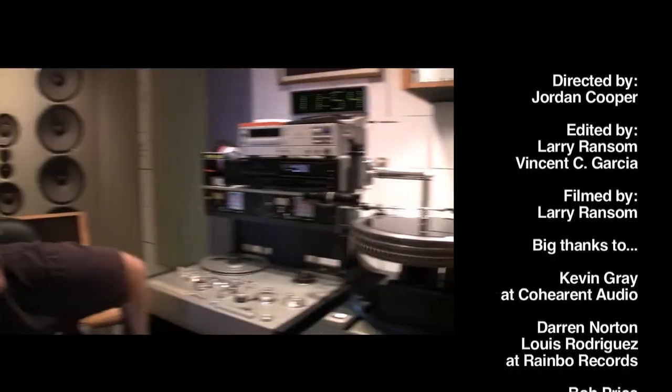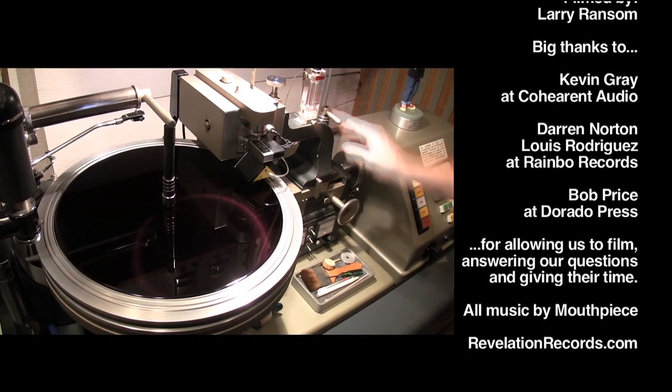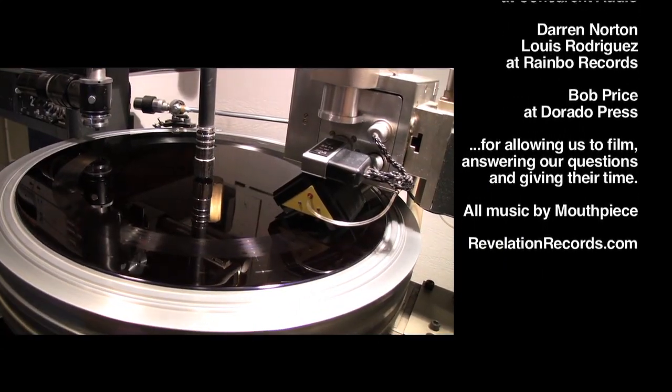And that adjusts the groove spacing by knowing in advance what's coming. So it has to look at the information prior to cutting the groove. In this case, it's about a half a turntable revolution. And it adjusts the groove spacing and also the depth of the cutting head for maximum volume and/or time. The groove vibrates side to side and to some extent up and down in stereo. So you have to be adjusting the speed of the motor that moves the carriage with the cutting head across the disc. And that's all handled by computer now.